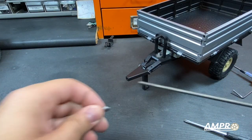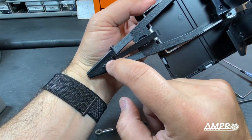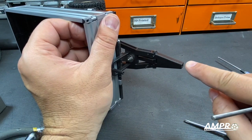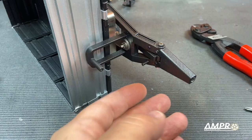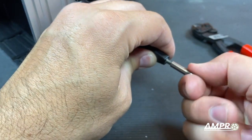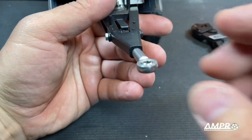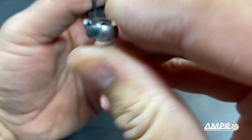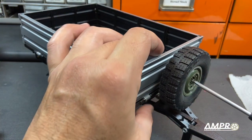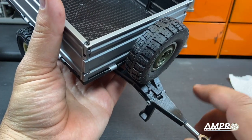The last thing is to install the threaded rod. First step is to figure out how deep this goes in, because I want to use as much of it as possible. It's actually open right there — this whole thing is a completely open void. I'm going to have to use an M4 tap to tap that and run it right in. The tap I used didn't reach the entire depth, only about 20 millimeters or so — so that's the length of the threaded rod I cut off. I'm going to put a bit of blue threadlock on it and make sure it's as flat as possible. I've also got this tire I'm probably never going to use again — stick it on there with 2.5mm diameter thread screws.